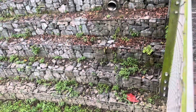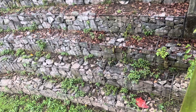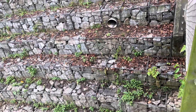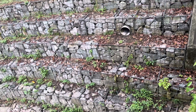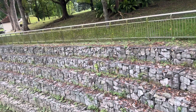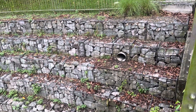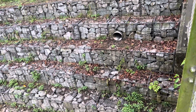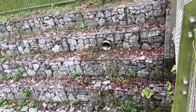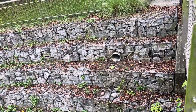Once it is filled with rocks, the next layer is also put over it, then rocks or boulders again — combining big and small — making sure that the surface side is nice to see, just like that, looking like a riprap, a plain boulder riprap. Because of the wire mesh, the gabion wall is called that.